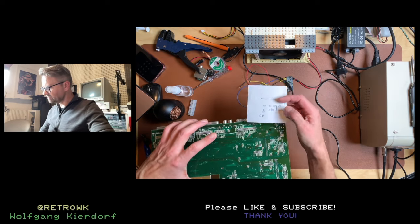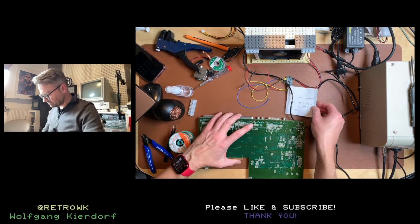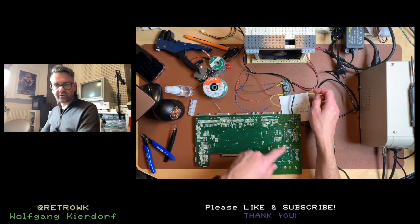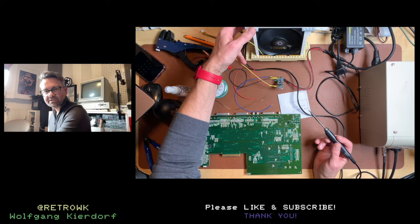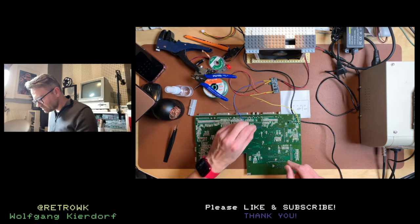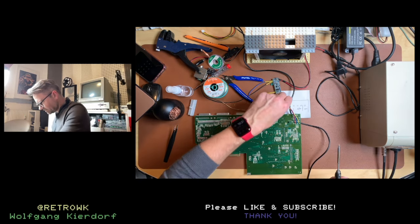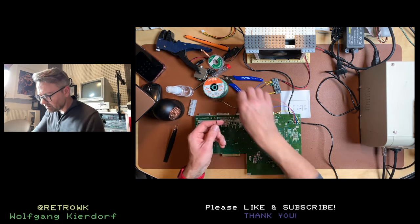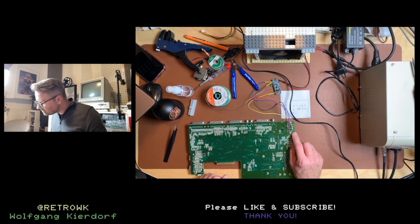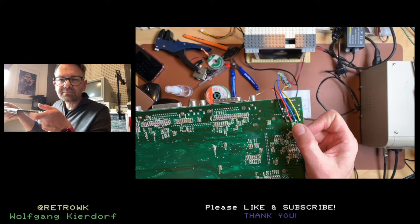I have my board out here with my cheat sheet: plus 12, minus 12, 5 volts, ground - that's these four pins here, which are in the corner of the board. Let me put on some fresh flux first. Plus 12 is the yellow wire on the right-hand side. By the way, this is my fume extractor. Plus 12 goes right here. Next up we have minus 12, which is the blue wire. Then the red wire which is 5 volts - and finally the black wire which is ground. That's all connected up - plus 12, minus 12, 5 volt, ground.